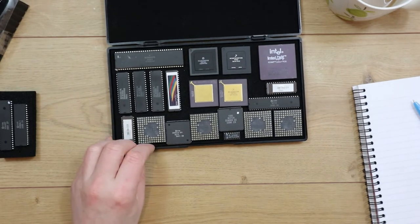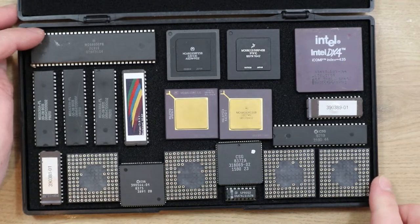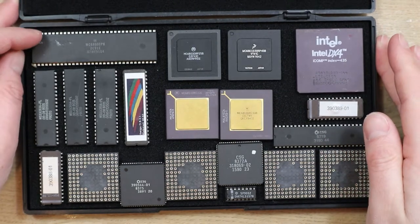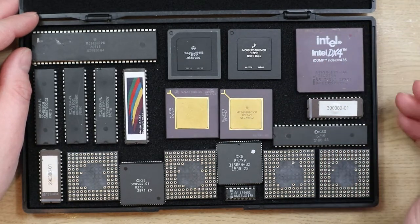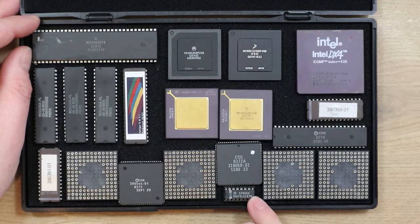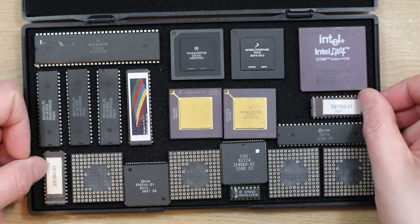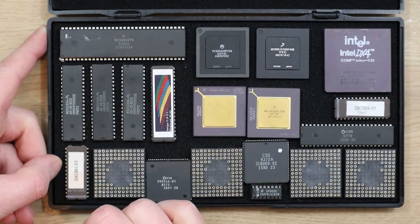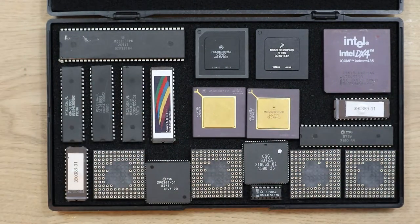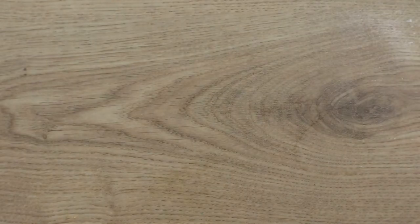This is quite a nice selection of various chips. I've got a Motorola 68K, probably out of an Amiga. Some were bought to put in Terrible Fireboards — obviously they've still not been put in. I've got some PC stuff too — an Intel DX4 for a 486 build, a couple of different Agnus chips, ROM chips, a multiplexer chip from an A500 joystick port, ROMs from an A590, and some chips that are an upgrade for the SCSI disc controller on an A590 which will also upgrade the card in the A2000. Some of these are probably quite valuable now so I want to keep them safe.